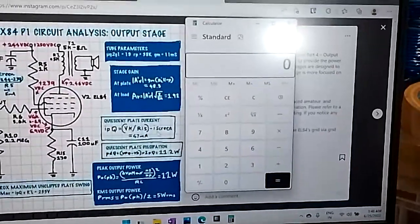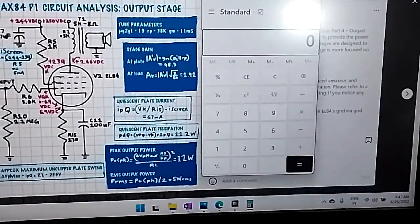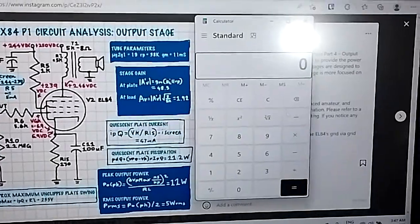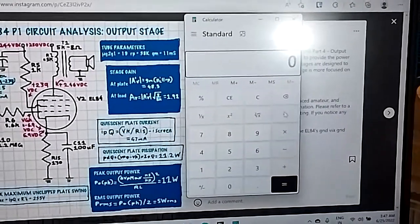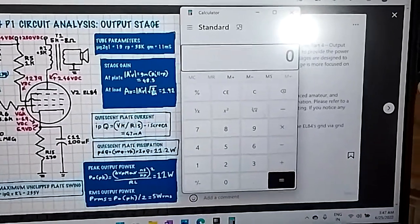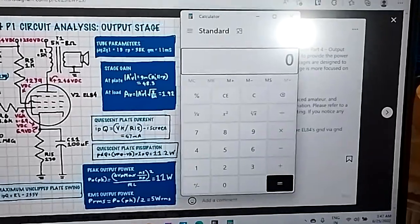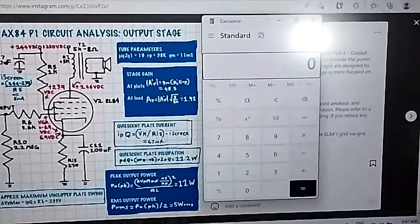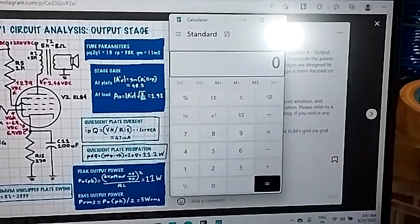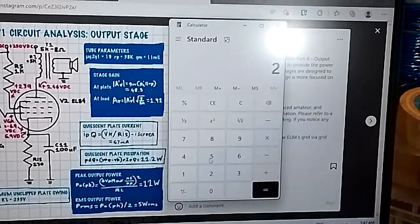Okay, so let's run some quick math. Now, based on the schematic, the quiescent plate dissipation worked out to be 11.2 watts, which I feel is a little bit too close to comfort to the 12 watt maximum of the EL84. But let's see what we are getting now. So first we need to know the plate current, which is going to be the cathode voltage divided by the cathode resistance minus the screen current. But let's neglect the screen current for a conservative estimate,